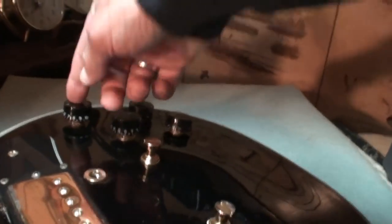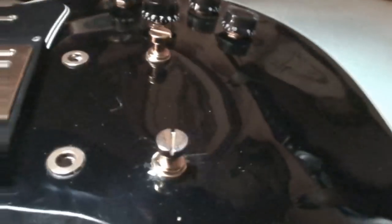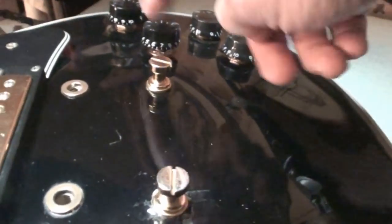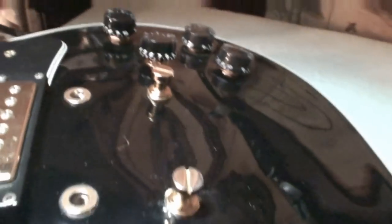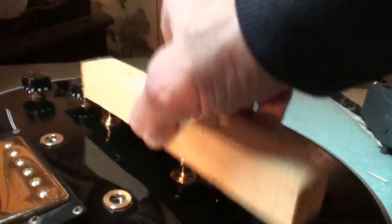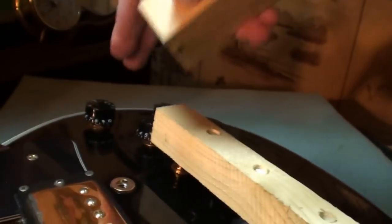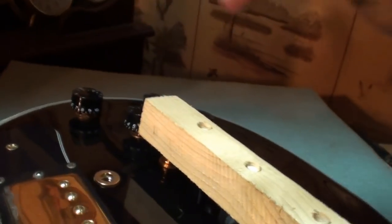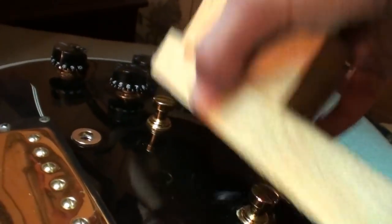The reason I have to use wood is because the knobs are in the way. Even if I took the knob off, the strap has to come right over it — that knob is exactly in the way. I could take the pot out but I'd have to unsolder it. So it's easier to put a block there, and another block — that'll increase the angle of the strap so the knobs won't be in the way. We're centering up on both inserts.